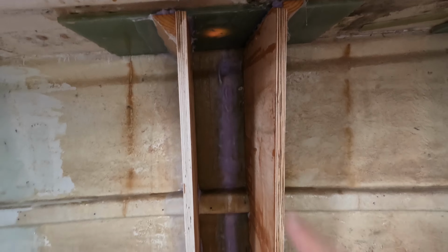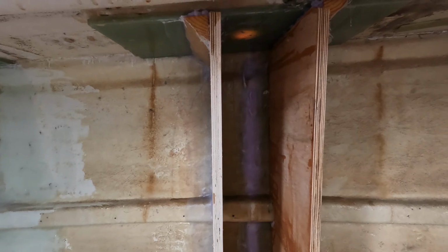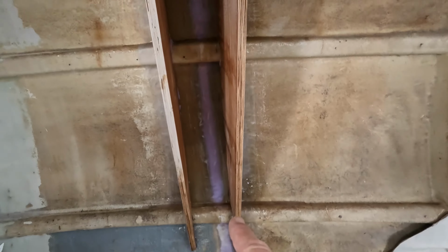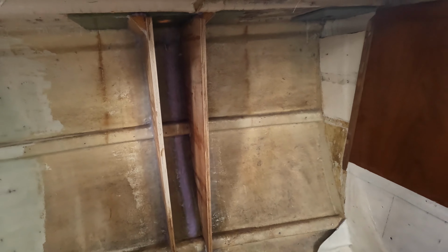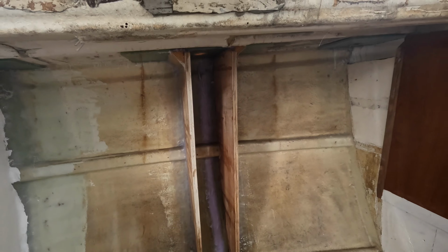And yeah, I think that we'll coat all of these in epoxy as we finish to make sure that they are watertight. All the edges, hidden edges, have already been sealed before they went in. And especially when you think, whilst on this port side it came all the way down to there, on the starboard side the equivalent bulkhead for the chain plate only came down as far as that first stringer. We will repeat on that side what we've done here. I'm confident that this is going to take enough of the loads off the cap shroud.